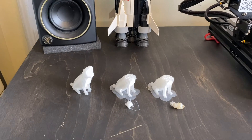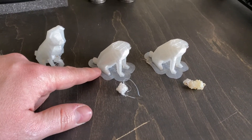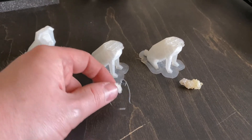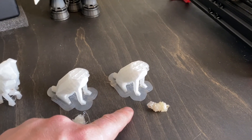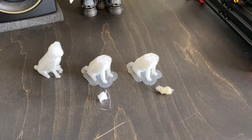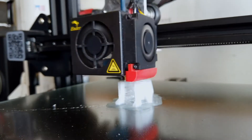The PC-TPE is giving me trouble — that's the flexible filament. The first attempt had the legs detach from the build plate, which happens sometimes, and I fixed that by adding a brim. But then when it got to the head it started printing a weird glob around the nozzle, meaning the nozzle lost contact with the model even though the model was still stuck down. I printed the exact same thing again and the exact same thing happened at the same spot. My theory is there's some sort of corruption in the G-code causing a Z-hop or something. So I regenerated the G-code and I'm trying it again — this time with a camera on it so if it happens again we'll be able to see why.